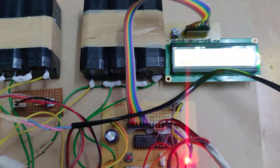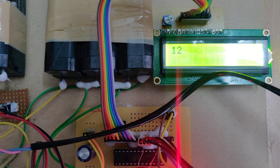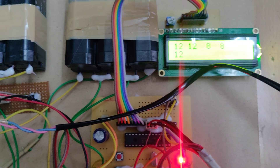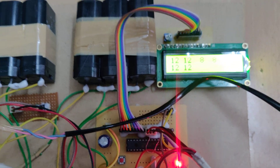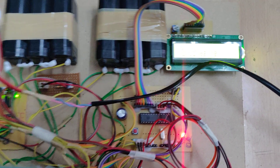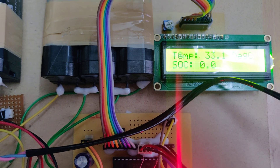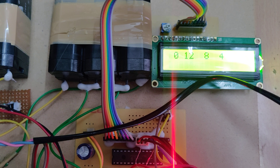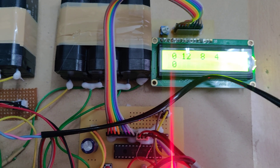You can check the voltages now. The first value is the input charging voltage. When we disconnect the input again, we get the exact battery voltages: input is zero, pack voltage is 12, 8, and 4 volts — because it has been partially charged already.